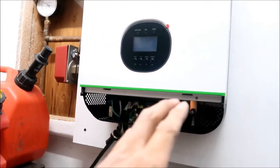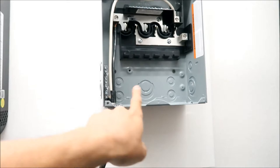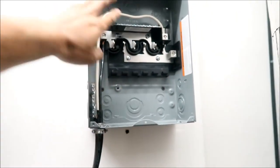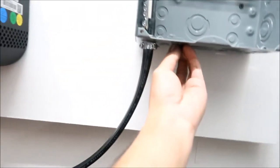So where this extension cord is right now, we're gonna make an outlet right here actually. So we'll probably have a circuit breaker right here, and then we'll run the wire, the ground, the neutral, and the hot, and it's gonna come out. We're gonna use this kind of cable, the MC cable, okay? The metal one, the metal clad cable. It's probably gonna come out up here, and then we can run that one down here. That's what I would do. Run it down here, okay?